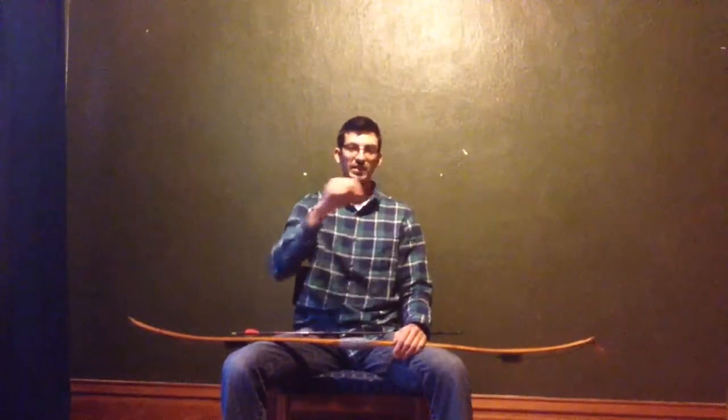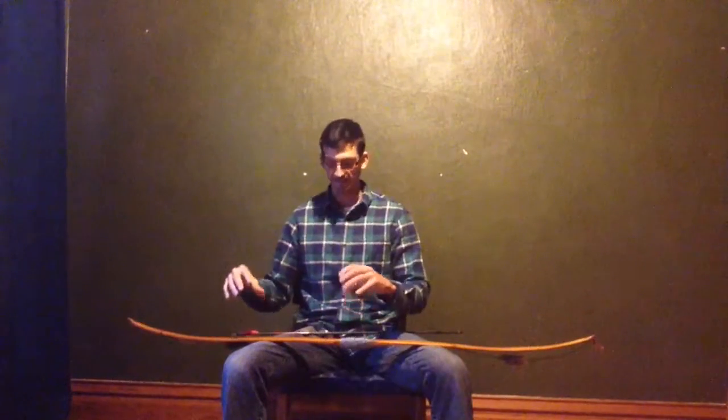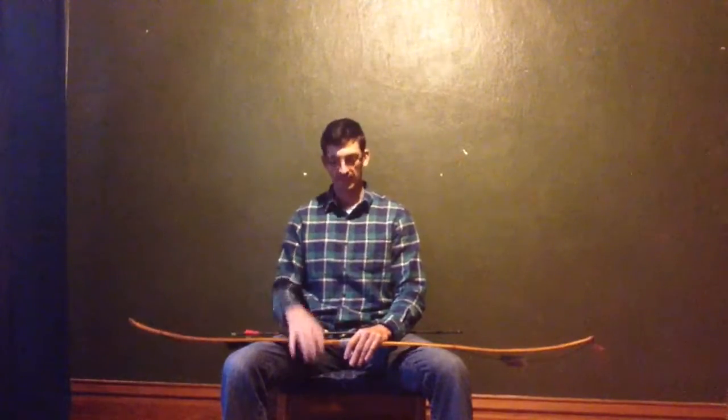So when I'm laying out the bow on the larger stave itself, which is the split piece of log that the bow comes from, I'll look at the individual wood fibers on the back of that bow surface, and I'll draw a line on the center and follow it. If it's wavy and snaky, I follow that. I don't force my will to make the bow perfectly straight, because the inherent qualities of the stave will be lost, and there's actually a risk that you're going to make a bow that's weaker when you do that.